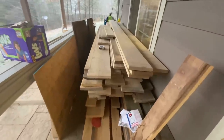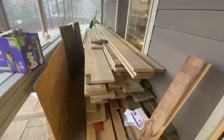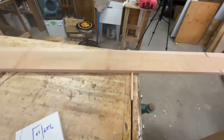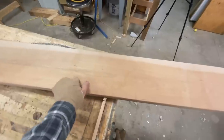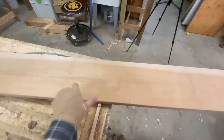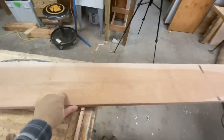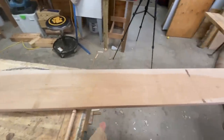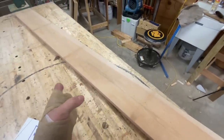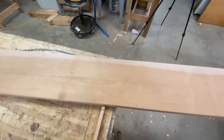This is the wood we're going to use - birch. It just so happens this is what I have; I didn't pick it for any particular reason. I will say of birch that it's a good paint wood because the grain is non-porous. It's like maple, and maple paints really nice, and poplar paints really nice too. You would not want to use something like oak or walnut or any open-pored grain wood for paint projects, because you can paint it ten times and still see the big open pores. So this is a good closed-pored wood - really smooth, easy to paint.